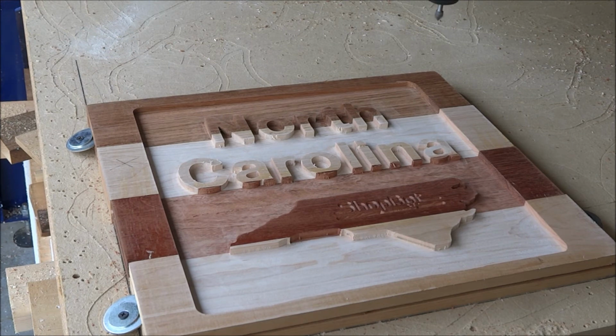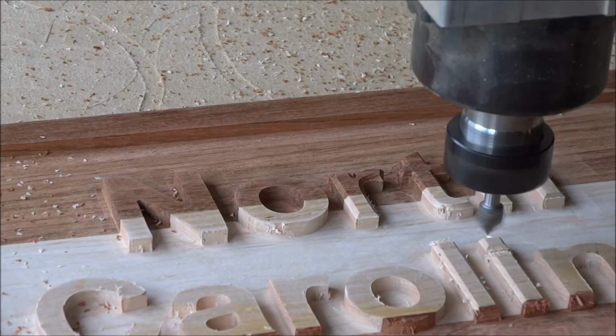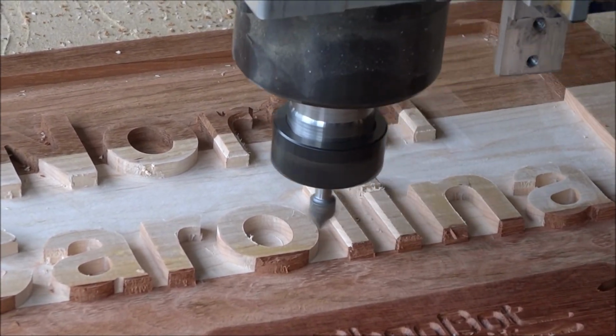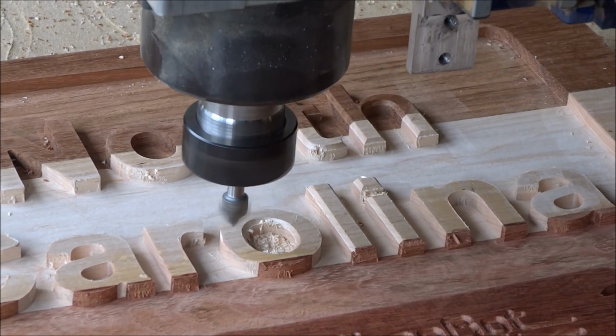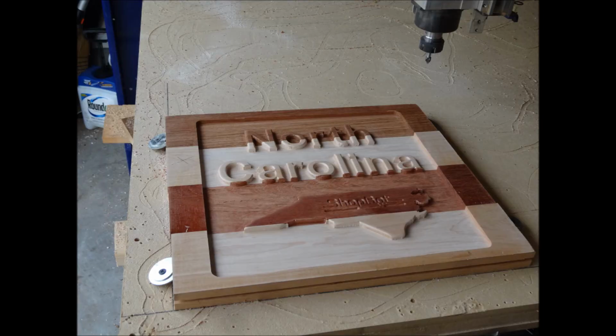Toolpath moves out of the way, and then it comes back in, and then it starts doing the prism toolpath that we set the V90 to go around at an eighth of an inch. So all I'm talking about is the order of the cut. We could have changed it around. It didn't matter. It was the same bit. And finally, we step back and we look and make sure everything's the right way before we cut this out, because once it's cut out, it's going to be hard to hold everything back in place.